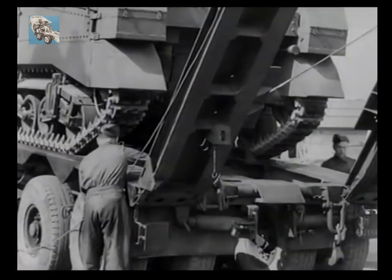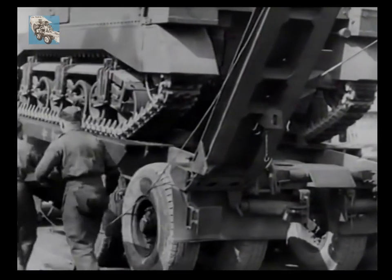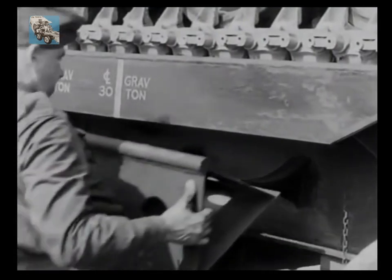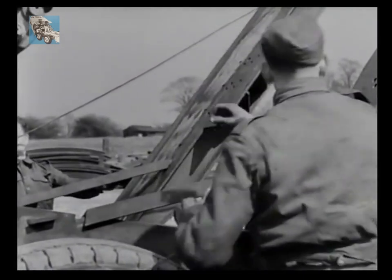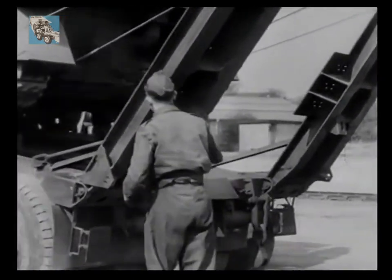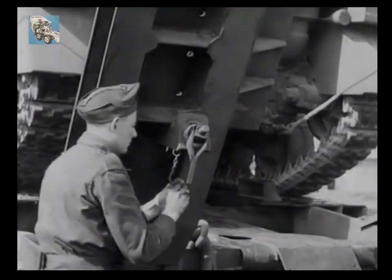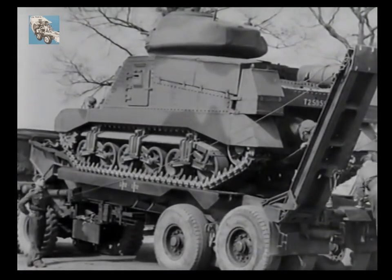Now to prepare for the road. Tail pieces have already been stowed. Next, the bridge pieces are removed and stowed away in the racks. The triangular ramp supports are replaced and secured on their hooks. The ramp struts are positioned and stays reinserted. Meanwhile, other members of the crew have winched in the slack cable and are taking up sufficient tension to enable the stay nut to be screwed tight. After this, tension is removed from the cable. Now the ramp-raising horses are removed and stowed away.